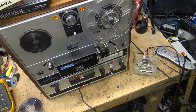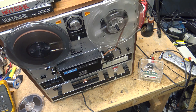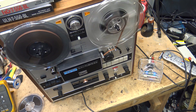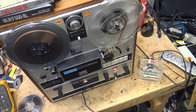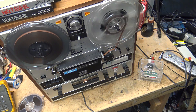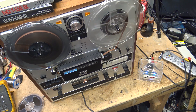Let's re-spool this tape and see if it actually works. I picked this particular tape to show you a phenomenon. Notice how slow the tape is moving on fast forward — that's because this back-coated tape was absolute garbage. The binder has penetrated through the tape coating. This is a tape that's known for the sticky shed syndrome. I don't think there's even anything recorded on this tape — it looks like virgin tape that's never been used.